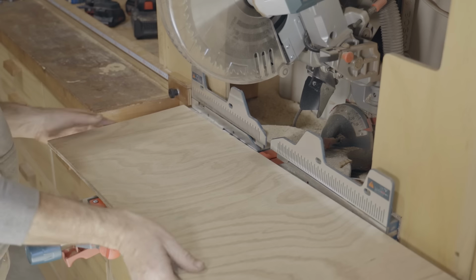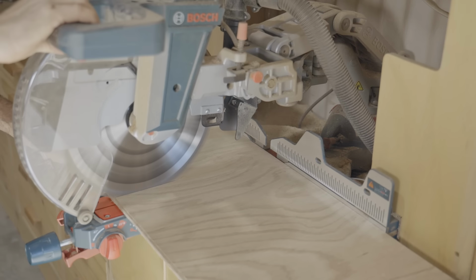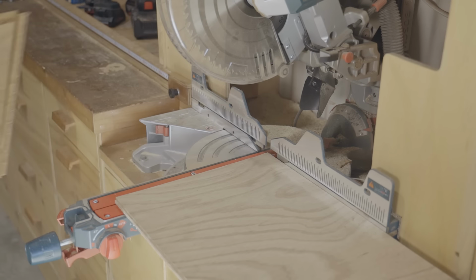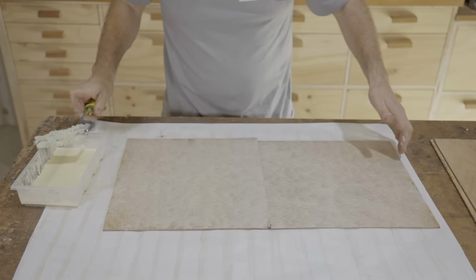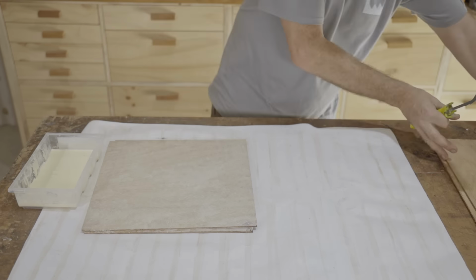Now on to making a seat, and because I need to bend ply later on to make a backrest, I'll be using these 4mm bracing ply offcuts and laminating them together, and because I want the seat to match, I'll be using the same for that too. I'm alternating the grain between the layers so it'll appear like a regular piece of plywood when looking at the edges.